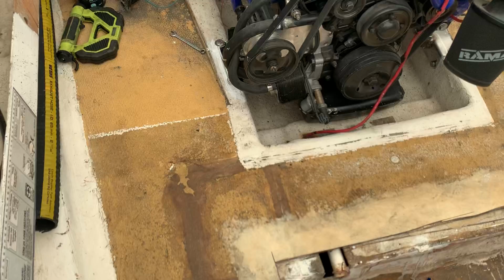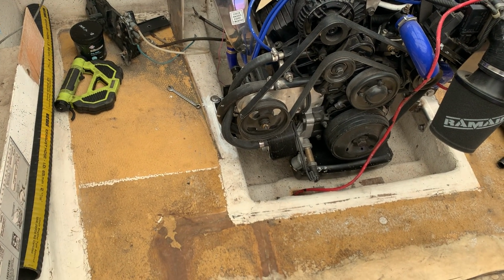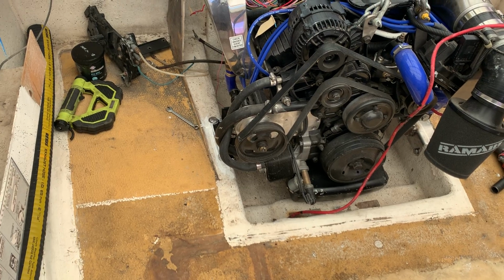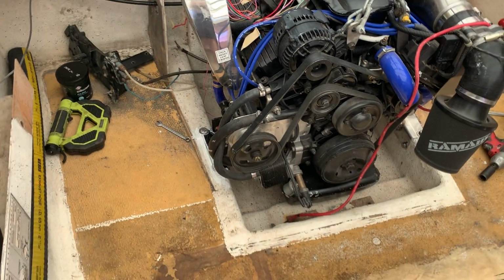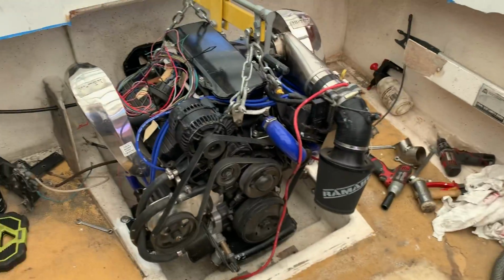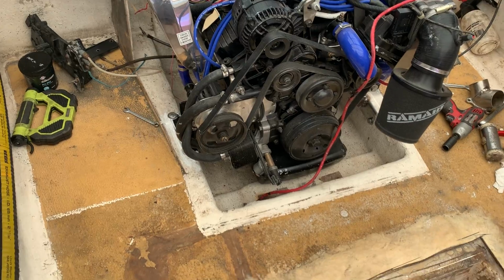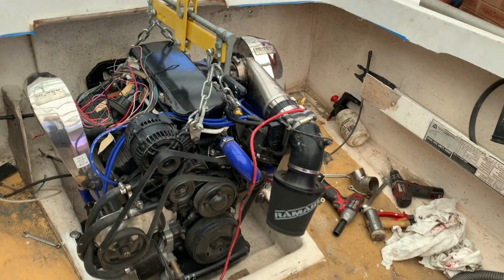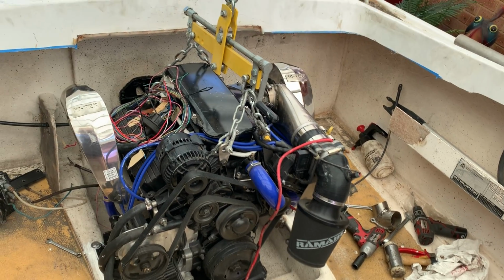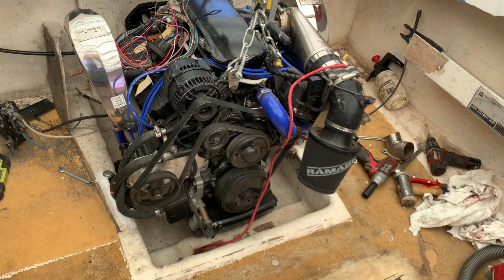And in all probability, I'll make another 4140 shaft for it. So there's another 2 days of machining on the mill and on the lathe, and yeah, that shaft wasn't very good anyway. I over machined the front of it and lost my press fit, but basically my big mistake was making the first shaft too soft, and things went wrong with it when I pulled it apart.